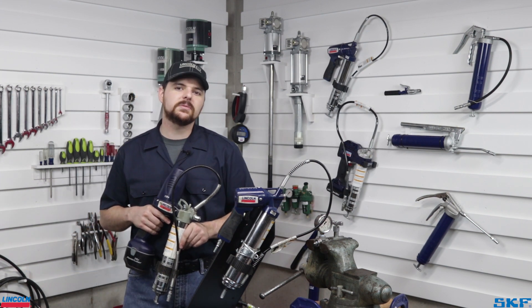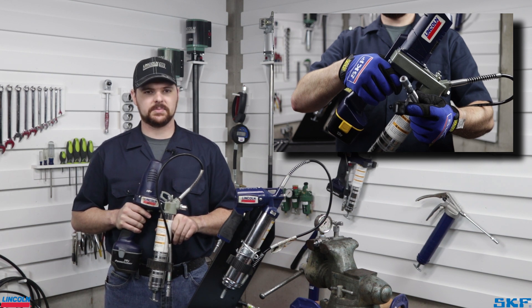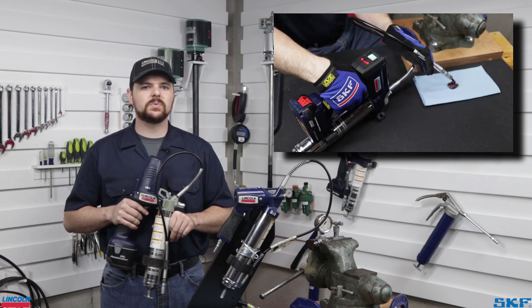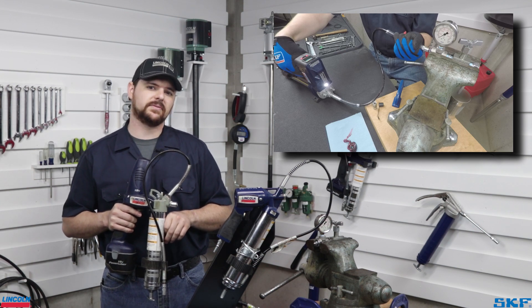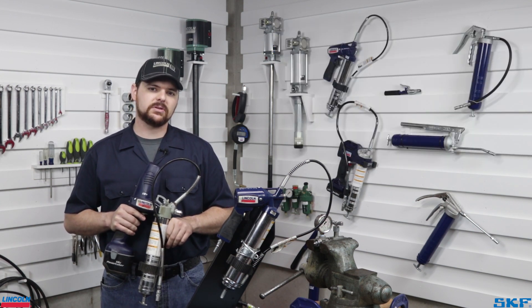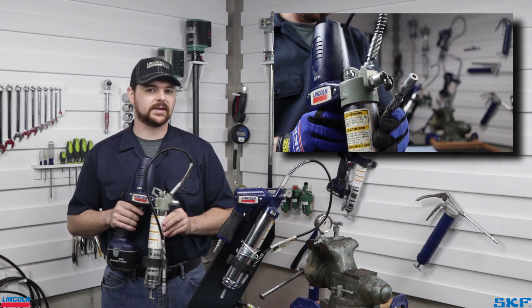This can show in many forms, but here are just a few of the frequent examples. Grease gun cycles but does not dispense grease. Unit dispenses grease while not attached to a fitting, but fails to build pressure or dispense when attached to a fitting. Grease gun cycles very slowly, stalls, or expels lubricant out the relief port without the coupler attached to a grease fitting.